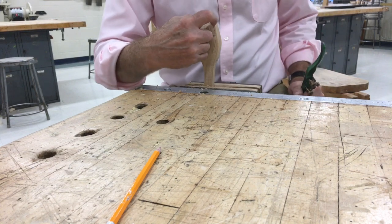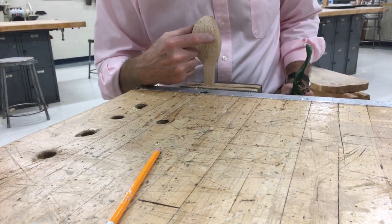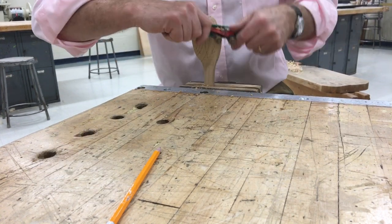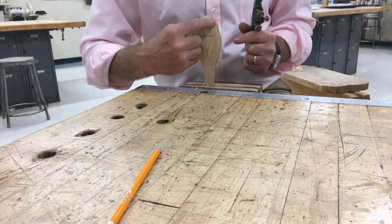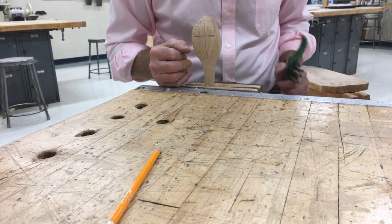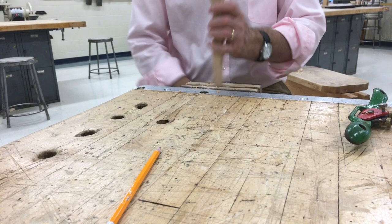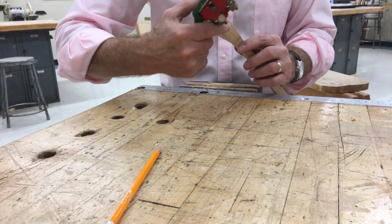The whole idea is you're eventually going to bring this bottom edge down to the edge of the front of the spoon, and you're going to bring the edge in the back — bring these two edges to meet back here and the spoon will be curved. Since you're always working in between the two edges, they're getting a little further apart and it's rounded in there. You've got a lot more to do in the middle of the spoon than on the ends. You never want to work right here on this edge — we want to end at that edge. We're always going to cut from the back and end on that edge.